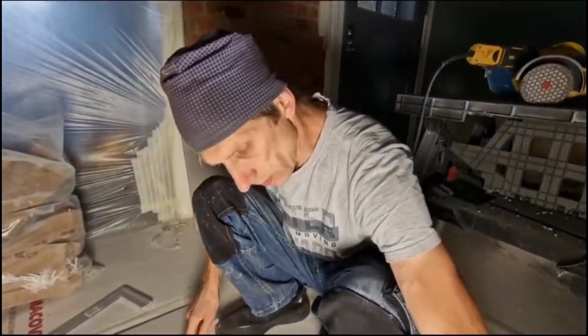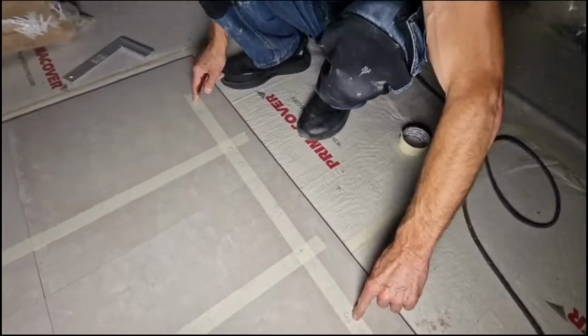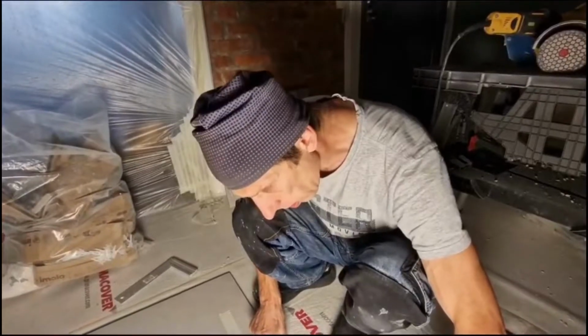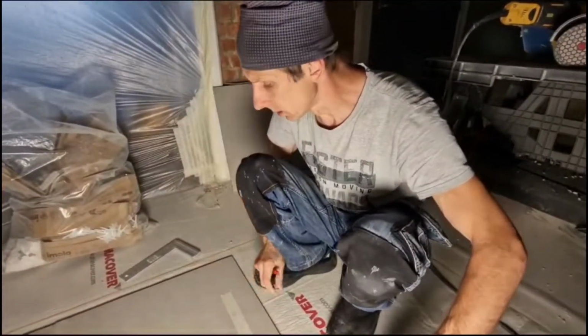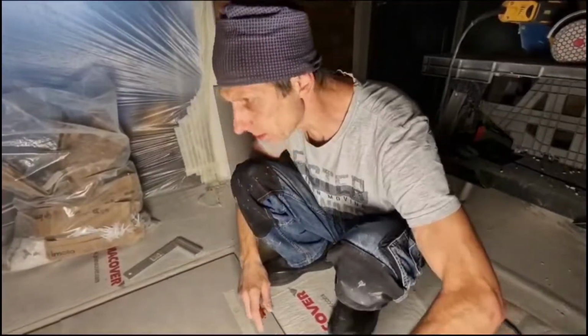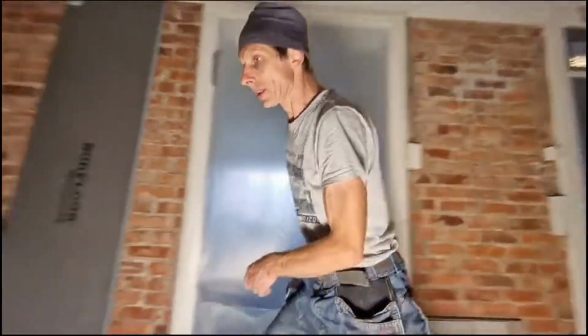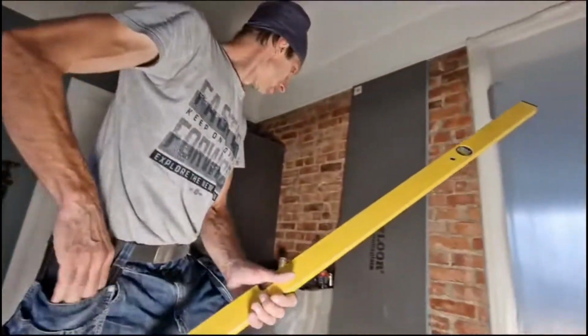The longer the distance from the line where you must cut, where you put marks, the more precise a measure you get. If you make measures on the corners, then it can be off by half and you make a mistake. If you make it further away, you get a more precise measure. And then afterwards, as you see, all tiles stay in place. You find just so long.